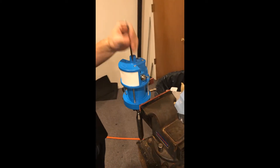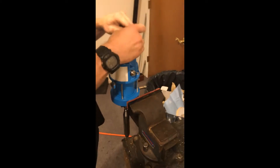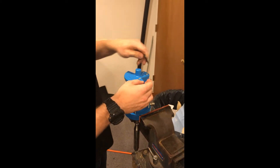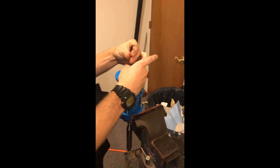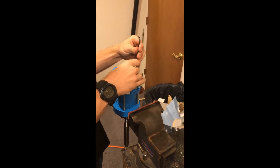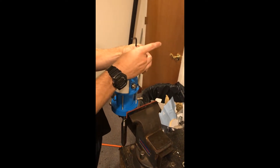We'll start off with taking the top end off. There are 4 bolts — they are 5mm Allen wrench bolts. You never want to do this with pressure going to the pump. As you can see, we have this on the bench.